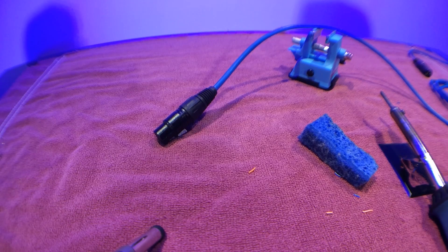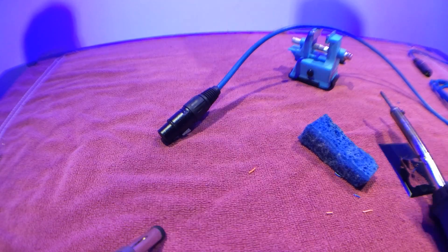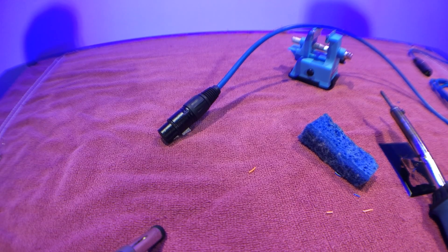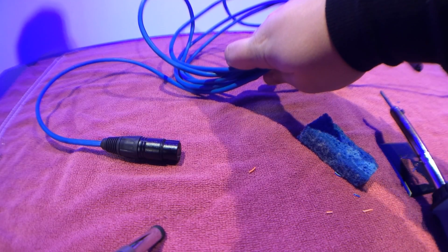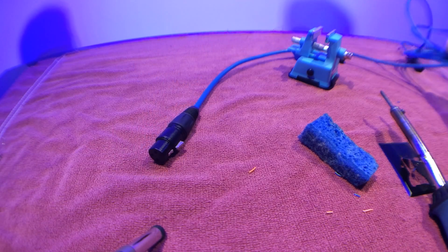One thing I will note: when you're doing these kind of cables, you want to make sure you use a CAT5 cable that you know has no breaks or no bad connections on it. This is very important. You don't want to use an old throwaway CAT5 cable or one that you're not sure of its integrity, because if you have a single break in this entire line, you can compromise your whole connection — and that pretty much defeats the whole purpose.